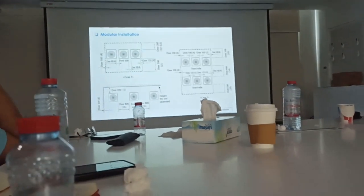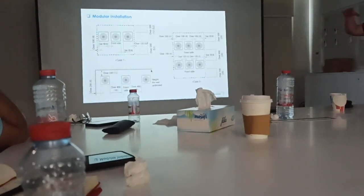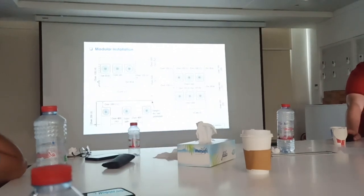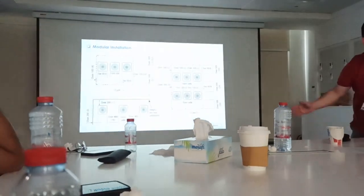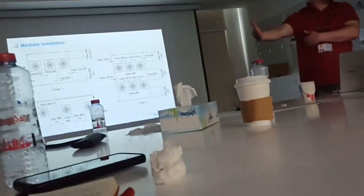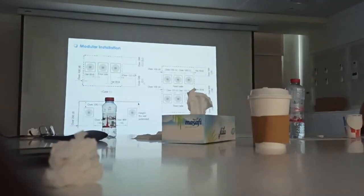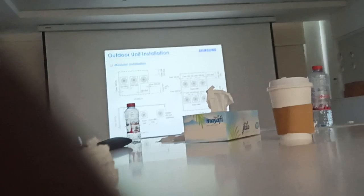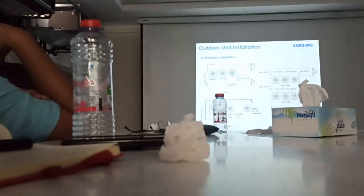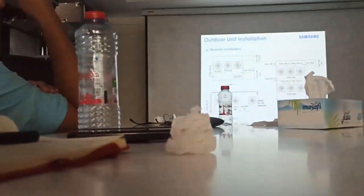Okay, you fix it on an unlimited wall or not unlimited wall. There is no condition like VRF top discharge. For the side discharge, you keep, as we said, 60 centi between the units. The back side is 30 centi always. It will not change for the side discharge. Only the condition will change if you are installing in a mechanical floor inside a closed room with louvers and these things. So that time there should be special conditions.